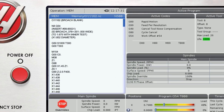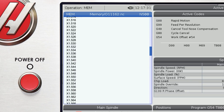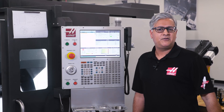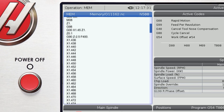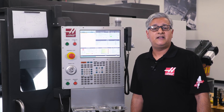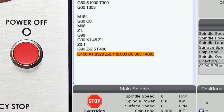Here is a typical lathe program broaching using G90 — pages and pages of code that cut the shape of a keyway. Each line on this program adjusts the axis ever so slightly in a positive direction until it reaches full depth, and if you need to increase or decrease the depth of cut, all this code would have to be rewritten. Haas not only created a VPS template to eliminate programming for its customers, but also created a G156 canned cycle specifically to condense this routine to a few lines and allow the user to make changes in seconds instead of minutes or even hours.